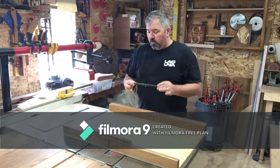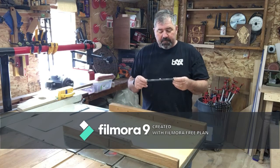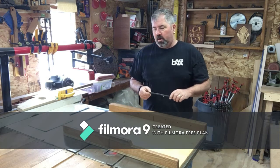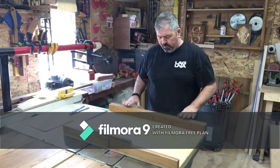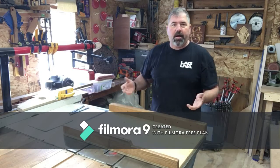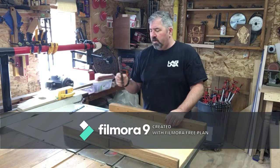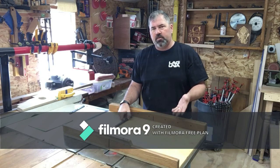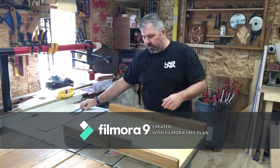So let's get started. The runners on this particular sled are the micro jig adjustable runners. I've taken them off of this sled already. I like them, they're a little short, but I think I'm gonna use them again on the new sled. This is a real heavy sled. It's 3/4 inch plywood with oak front and rear bridge things, handles to keep your fingers away, the fence, those things. And it's a heavy sled. Even though these are very good and I'm going to reuse them, they're short. And I was cross-cutting slabs, which I shouldn't do on a table saw sled. And it got a little wonky. No fault of these.